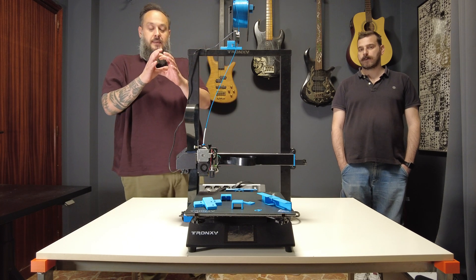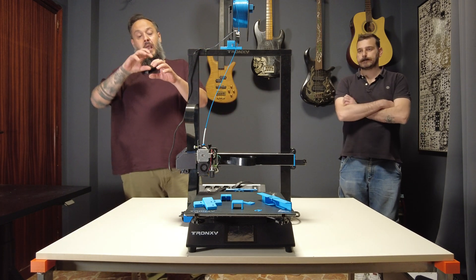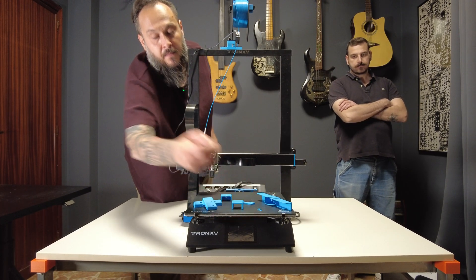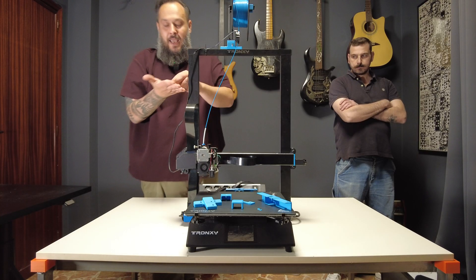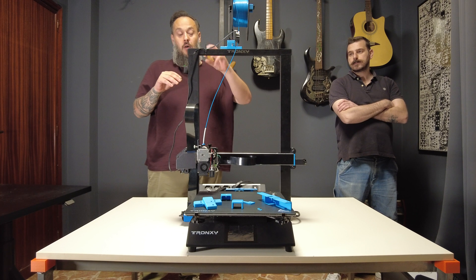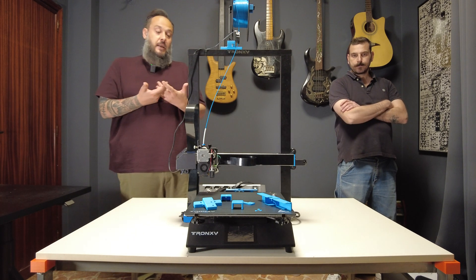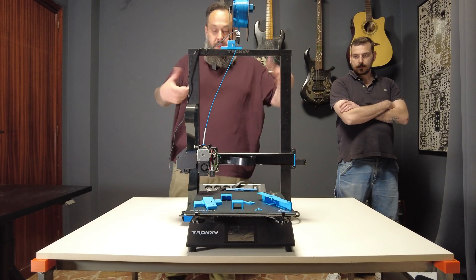How the pulley works is that it has a fixed part and a moving part. If you put a standard screw in the timing pulley, it will grip with the pulley itself and won't be able to rotate correctly. So what I did, I printed these small washers so that the screw attaches to the washer and does not block the rotation of the timing pulley. You can also use plastic elastic o-rings — they serve the same purpose. I like to print my own stuff. So now the belt grips on both sides.